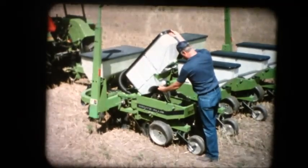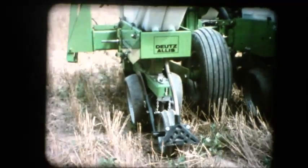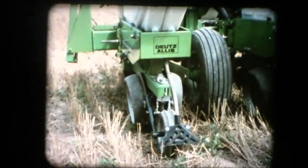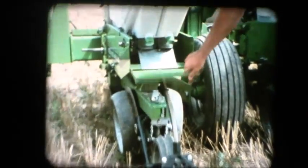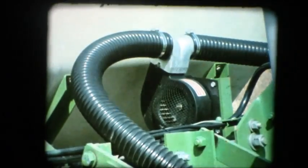You can easily reach all internal components for inspection and maintenance. Easy access has also been designed into the rate meters for granular pesticide chemicals. Just lower this shield and move the lever to change the rate — it's safe and simple. The seed metering system is an integral part of the hopper. The seed housing increases accuracy and reliability. Metering is done by an air singulation system, where small electric fans generate a low volume of airflow that singulates the seed into the individual pockets of the seed disc.